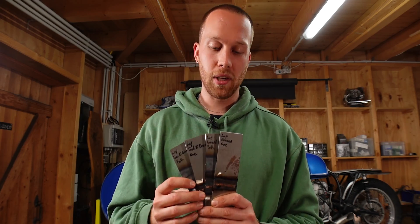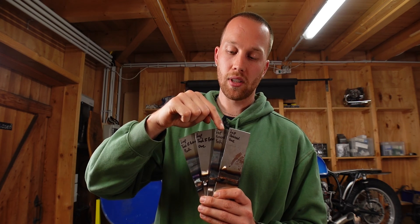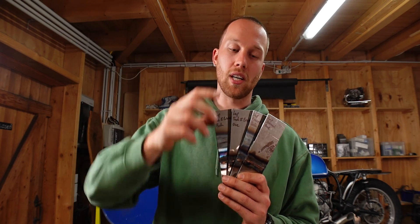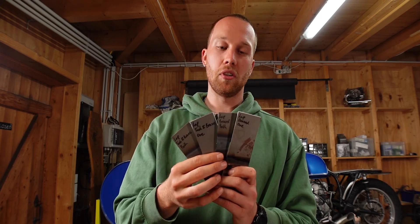I've prepared four little test pieces to try to break apart and see how strong the joints actually are: TIG brazed on just one side, TIG brazed on both sides, TIG welded tacks on each end with braze in between on just one side, and the same on both sides. I'd guess this would be the least strong, and then the rest should be pretty solid.